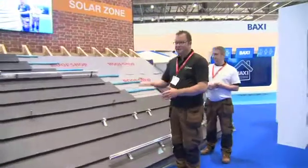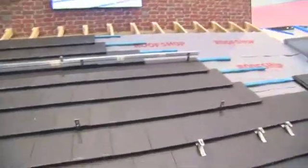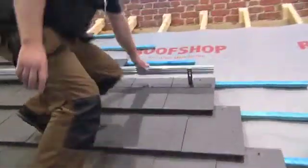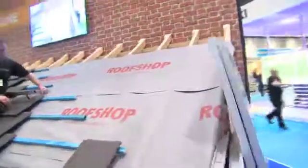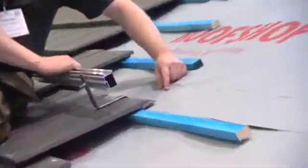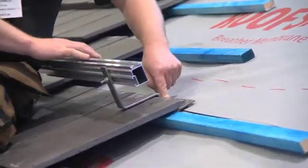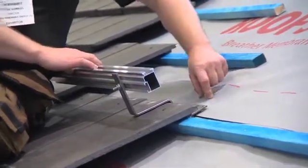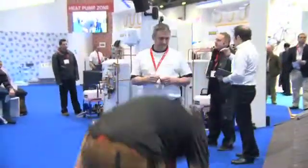Blue Peter style, we've already mounted the top rail and we've got some of the roof hooks in the roof. We've left a slate off for you to see how the roof hook mounts to the rafter — it's fitted directly under this part of the felt here, screwed in with stainless bolts into pre-drilled holes. That's very important because rafters on modern houses are very narrow; if you put a big fat screw in without pre-drilling, you're going to split it.